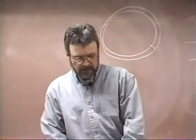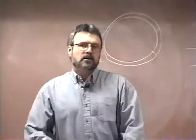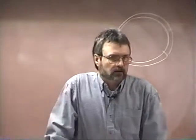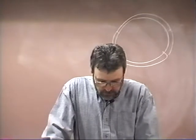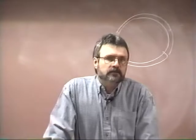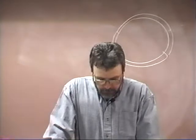The higher tensile strength of E8010 as compared to E6010 really cuts down on the fluidity of the puddle. Its characteristics are quite different, and that's why you're not going to have as much movement with E8010 as you are with E6010. You don't often see root beads deposited with E8010, but it does take place. So remember that, and then we're going to switch over. I would read the rest of that and come over to the page 129, first paragraph here.